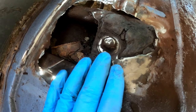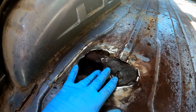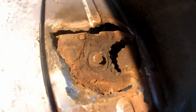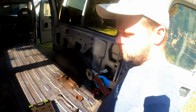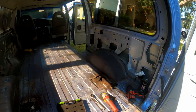There's a little plate with two tabs on it — if you spin too hard on this, all it does is spin and bend the tabs, which we did on this one. Same thing here — cut out a little bit around, and we're probably gonna go to the underside and tack weld that tab to keep it from spinning, and then maybe try and tighten it back down again. You know — measure twice, cut five times, and then you're probably good.